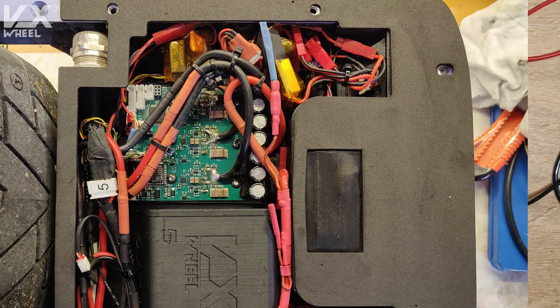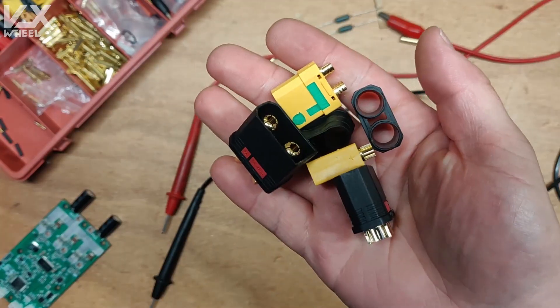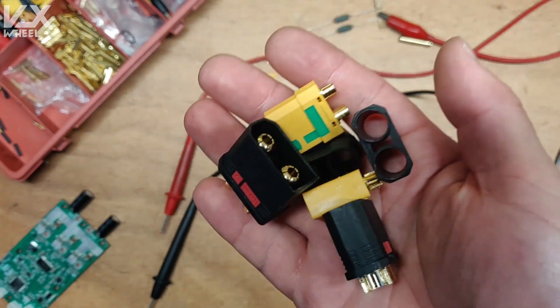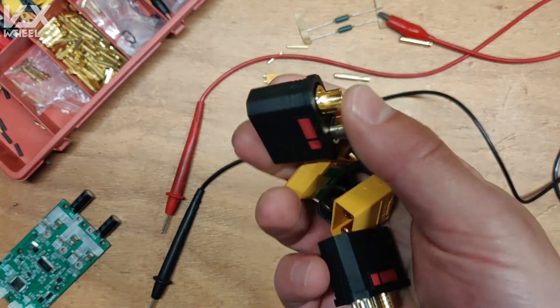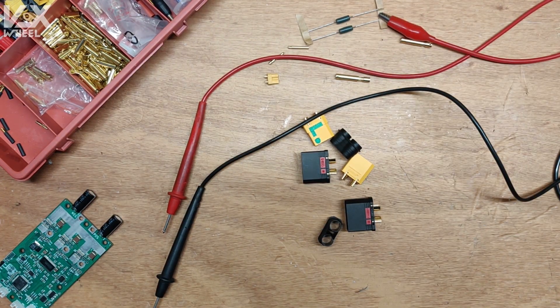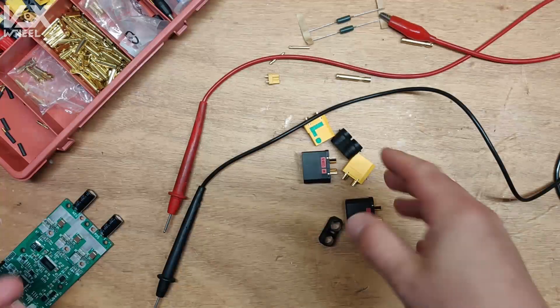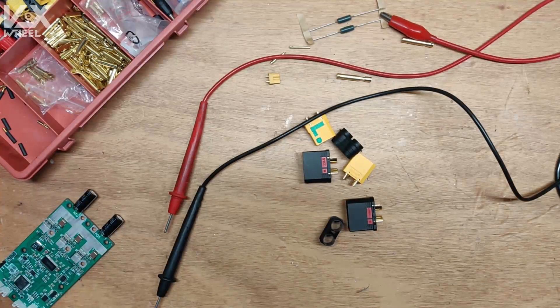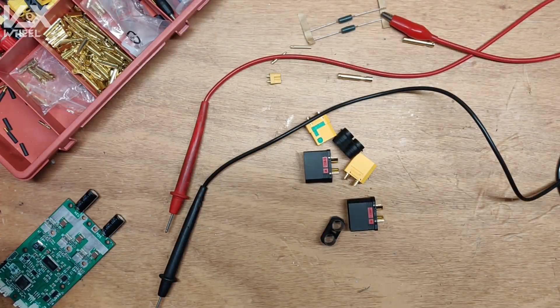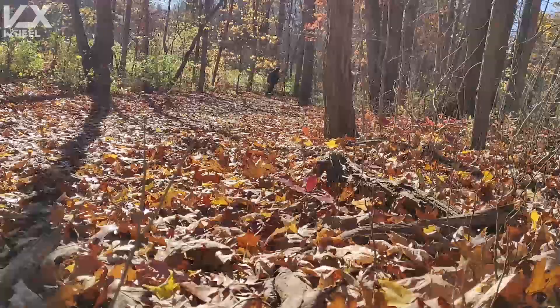So you have nothing to worry about, but if there's a chance to disconnect it, why wouldn't you? Just make sure you leave no contacts unisolated or exposed. As a conclusion: the pre-made connectors are way more user-friendly, and hopefully the larger connectors will turn out good — but from the operational aspect, the manual anti-spark is way better and should create no problems over time. It's up to you whether you want to deal with extra wiring and complicated stuff or use these connectors. There might be other options too, such as pre-charge boards that do the pre-charge through a relay automatically, but that's even more complicated and I won't cover it in this short video. Thanks for watching — I hope you learned something today, and see you on the next one!